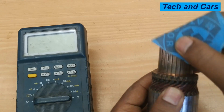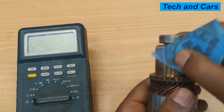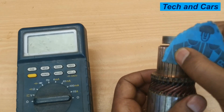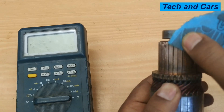You can use any ordinary multimeter for this test. Simply make sure that you are putting the resistance value on the lower side. When testing the electrical winding resistance, select the lowest range on your multimeter, because we are expecting a very minimum resistance reading for this particular measurement.